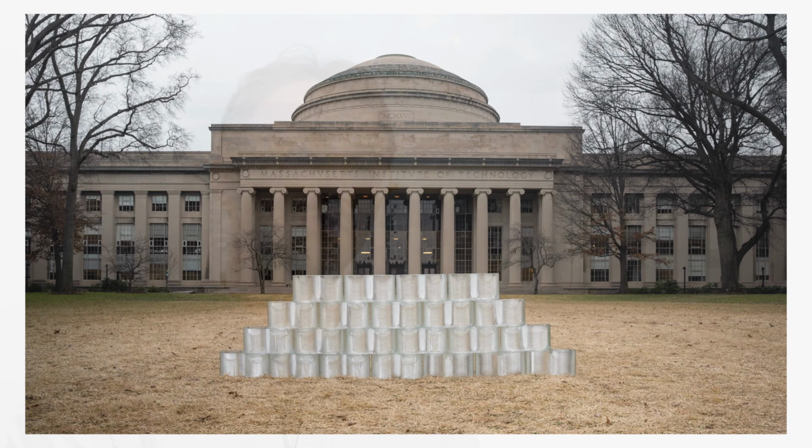I think there are certain limitations with molds. Obviously there are some limitations in the manufacturing process as far as the cost of being able to make different molds, especially if you're using reusable molds. But also you have a chilling factor. So the longer your path of where the glass is flowing into the mold, the faster it'll cool, and you have some limitations there. When you're using 3D printing, or the type of 3D printer that we're using, you can have a pretty thin wall, but extrude it along a long height or length. And so that's one application that I think we're particularly well suited for producing.